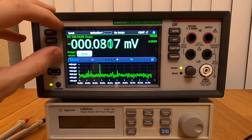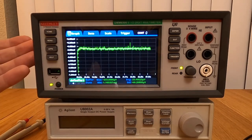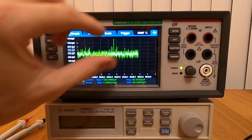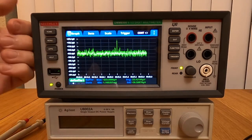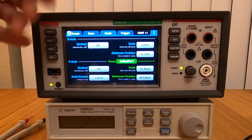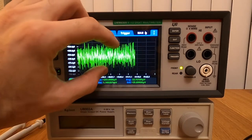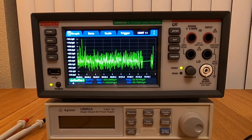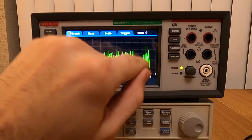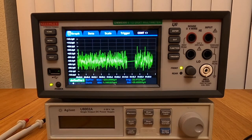You can have both the main multimeter display and the graphic on the back, or you can move to a view with the graph full screen. And look at that — you can zoom with your fingers. I believe it is useful because if you're looking at the RC charge or discharge curve of a capacitor, you don't necessarily want to go into the menus. Sometimes it's good to just zoom in, stop the trigger, look at the area of interest, then restart the trigger. It even took into account the time during which the trigger was stopped. Good job on the user interface — very convenient.